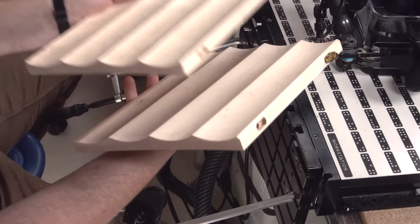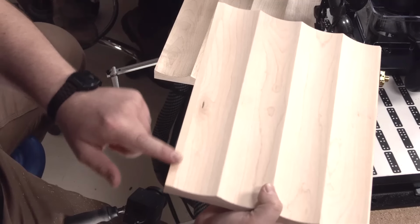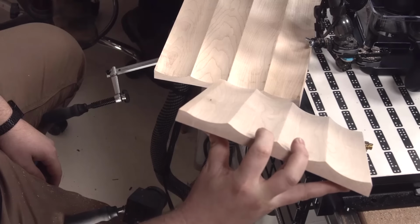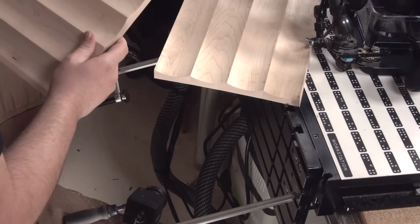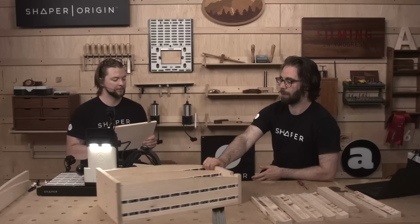The other thing that you're going to want to take down with a hand plane is the opposite side. And what this does is allow that little door cover to conceal the little gap between the right and left door, the reveal between the right and left door. So that's the only other further work that we would need to do on this, but we're not going to install that today because we're not going to be able to open it.